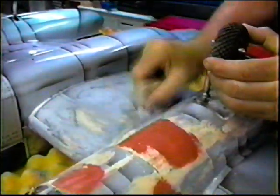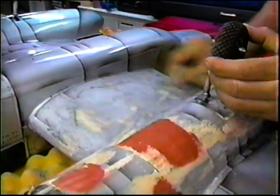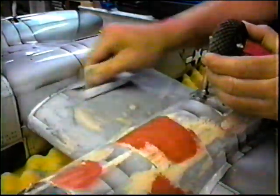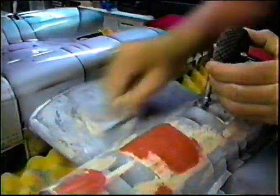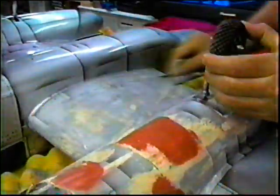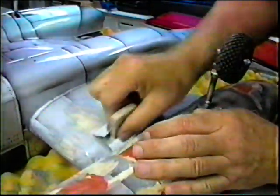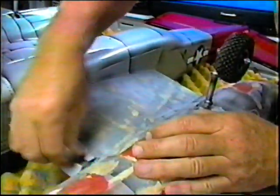Again, you can't fiberglass over something shiny and bright. Anytime you're using fiberglass, you want it to be rough. Minimum 80 grit paper, so you have some scratches so the epoxy can get down in there. In any spot, in fact, we got a spot right there. And get rid of all the bad spots.